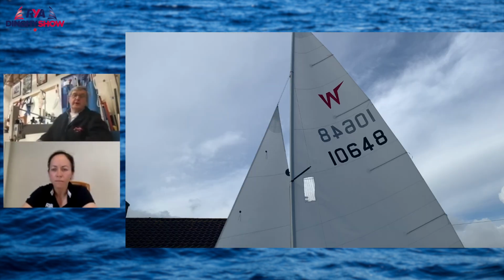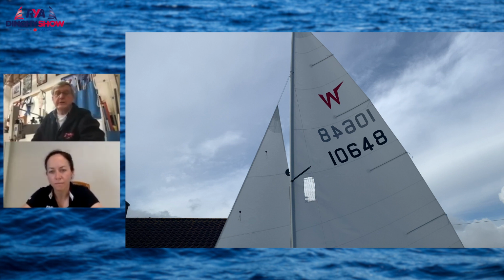Can you see, I hope, that the kicking strap is at an angle to both the boom and the mast. So there is a diagonal, there is a downward load, but because of the angle, the boom is forced forwards under the load of the kicker. And that's what causes the mast to bend. By forcing the boom forwards, the mast bends, the sail gets wider and flatter, and that reduces the backwind. And this is why the kicker must take control as soon as the boom goes away from the center line.